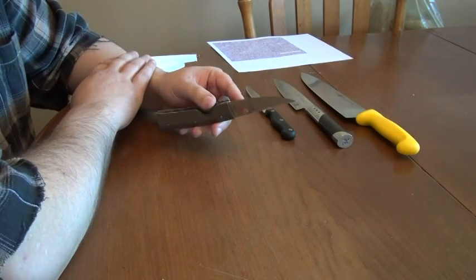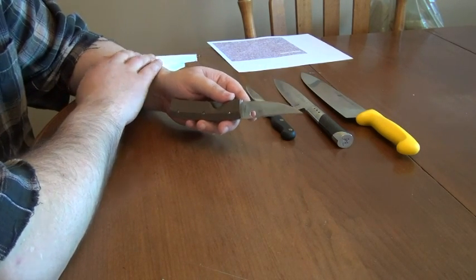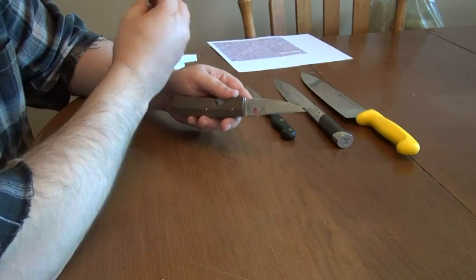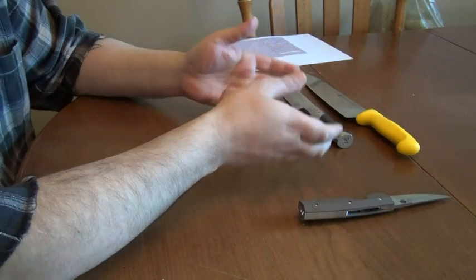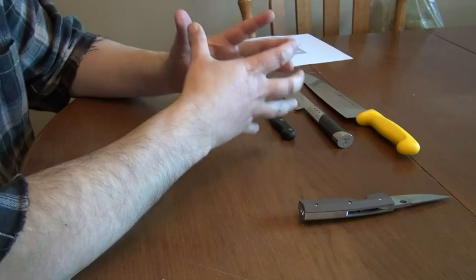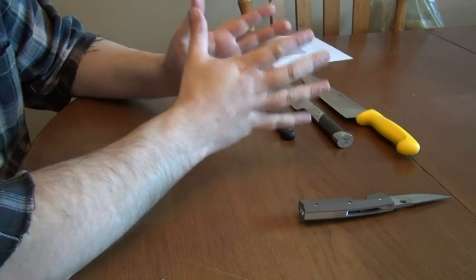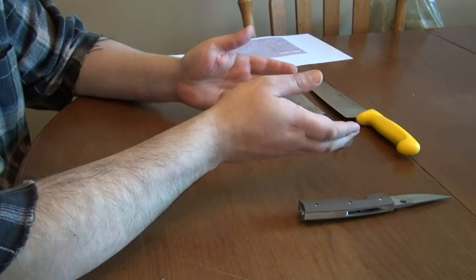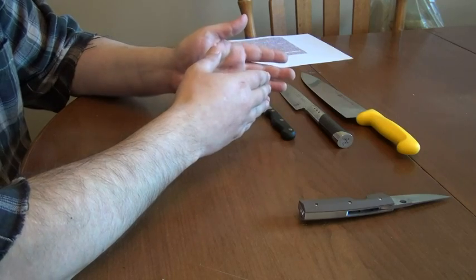So back to this knife. Why is the edge breaking apart? It's obviously a very hard steel. It's very strong and you're not really subjecting it to an impact — you're not smashing it off something hard, so there's no violent chipping or cracking involved. It's obviously a strength issue because it's being loaded very slowly, and that's the inherent difference between strength and toughness. One of the easiest materials to think about to understand that difference is concrete. Concrete is extremely strong — you can put enormous weights on top of it and try to crush it and it won't do anything. But if you take a hammer, even with a light pop, you can break concrete. It's not very tough. Very different things happen inside a material when you put force on it slowly versus quickly.